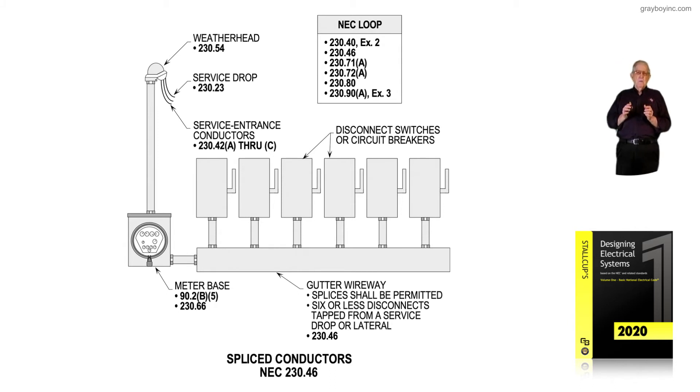We pick up those tap rules by those specifications. If you were tapping from the secondary side of a transformer with secondary conductors at a supervised industrial location, you would reference 240.92(C) and (E). Under 240.92(C), you could tap over 25 feet with transformer secondary conductors up to 100 feet. And by the application of 240.92(E), you could tap with secondary conductors any length you wanted, as long as you had the formulas and provided the right protection.